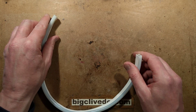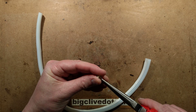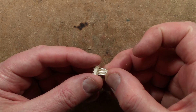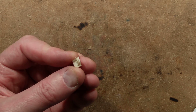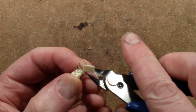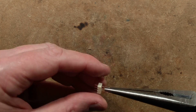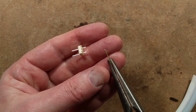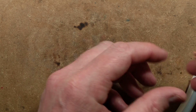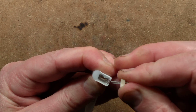Let's look at how you'd connect onto this. I've found you can make a very compact connector by getting little three-pin Molex-type connectors like this. It's a little three-pin circuit board Molex-type connector. What I'm going to do is cut out one side — the little tab — and drag out the middle pin. They usually pull out quite easily; if they don't, heat them up with the soldering iron and they pop out. Take the ribbon and aim for those bus bars — this is where it all goes horribly wrong sometimes.